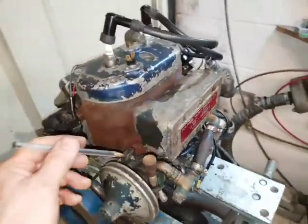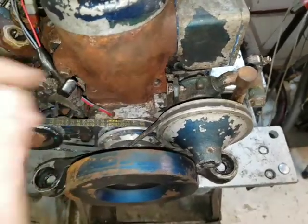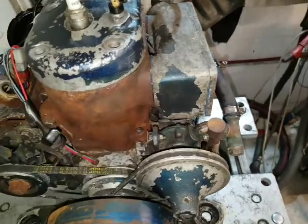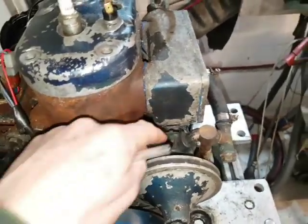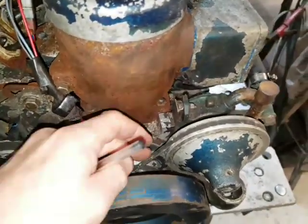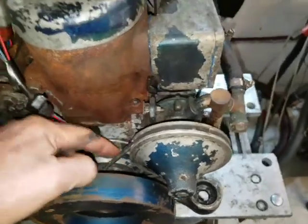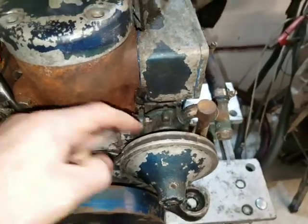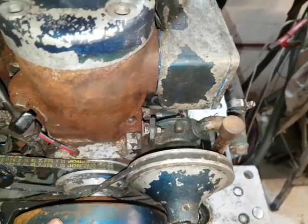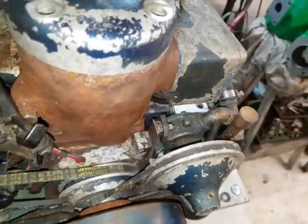But no, I don't like the front pump. You have to gear it down. It's got reliability issues of its own now, so it might be easier to change the impeller, although you could burn yourself on these hot bits if it was just run. But I can see it's going to be more unreliable, because if this belt isn't adjusted right or breaks, it stops the pump. That can't happen on a Vire. The pump's driven by the crankshaft directly. So as long as the engine's turning, so is the impeller, or at least its hub if you've got a bad one.